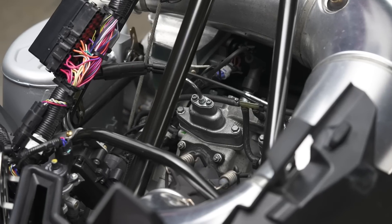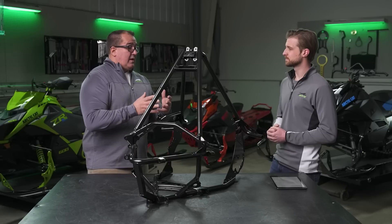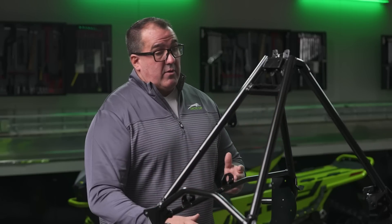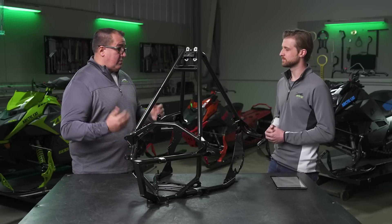When we talk about the Catalyst platform, mass centralization and low center of gravity is really at the core of everything — we've already talked about the lay-down engine design. The motor moved in our layout to start and we were trying to get it down as far as we could. We had all these other loose systems that weren't tied together, so we made a decision up front: we always had the TCL which joined our clutches, but we were going to make a pipe mount too that goes on top of it — a clutch guard slash TCL — allowing the pipe to move with the whole motor and taking all the weight down with it so it all moves together. Our clutches, our pipe, our motor — all of it went together, shoving it down, which also drove into locations of our frame members. Our upper arms went down, shortening our spindles. Roughly two inches, everything was moved down, and it's been a huge improvement to the sled.